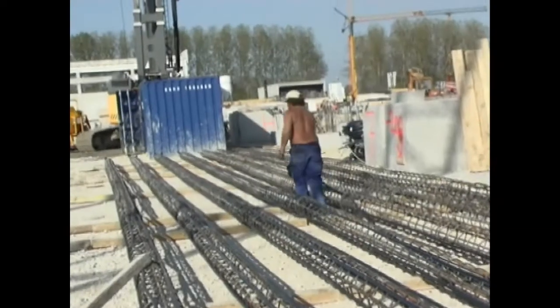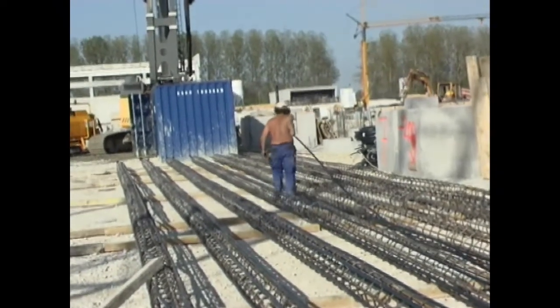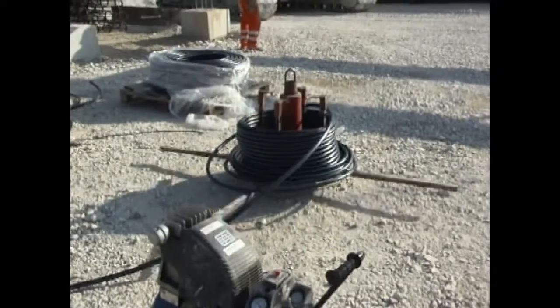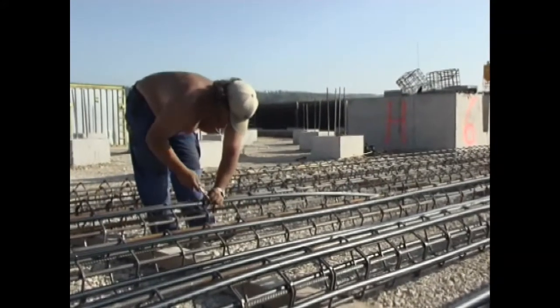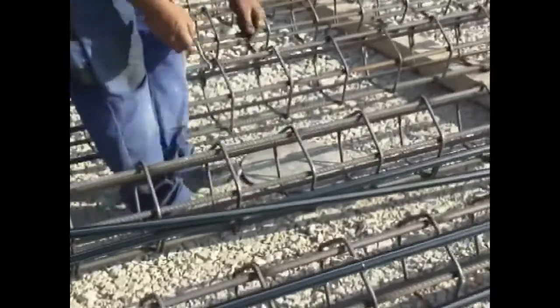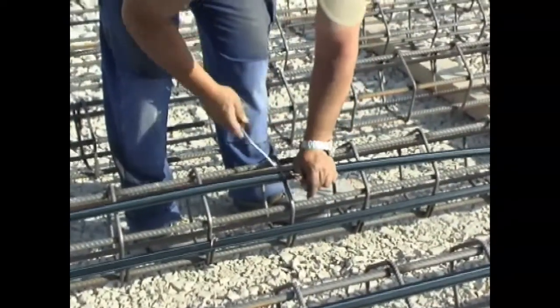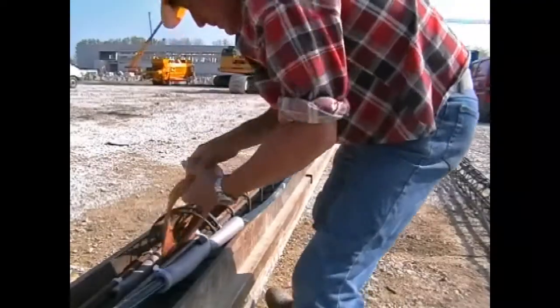In addition to the normal foundation piles, energy piles were also produced on the Domdidier job site. In this case, the reinforcement cage is inserted in one piece. The metal network is fitted with a hose which is checked for tightness. This hose is intended for the subsequent circulation of cold or hot water. The system utilizes the near-surface geothermal potential for heating or cooling.